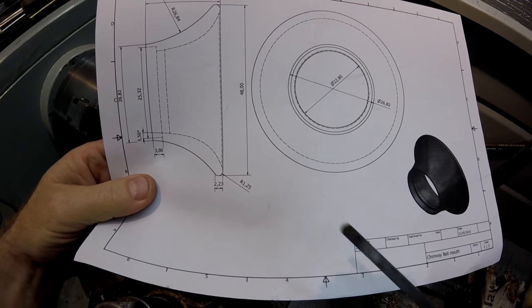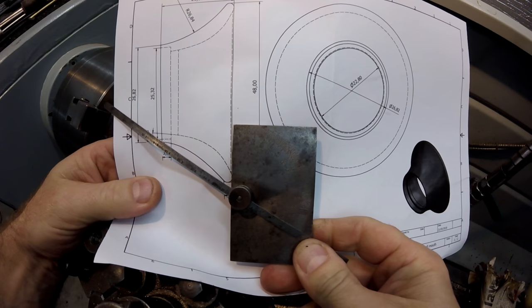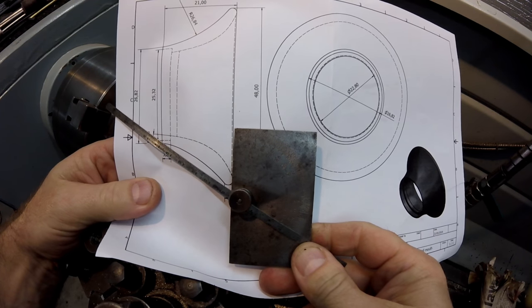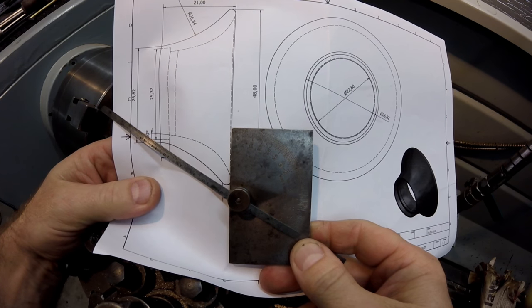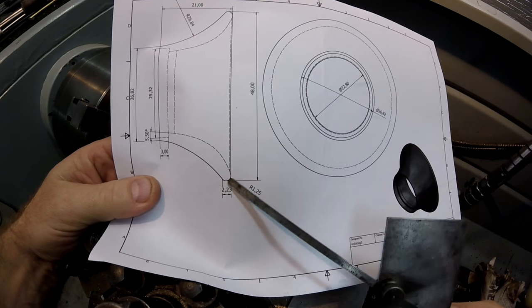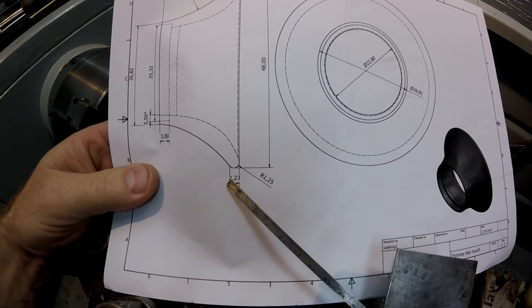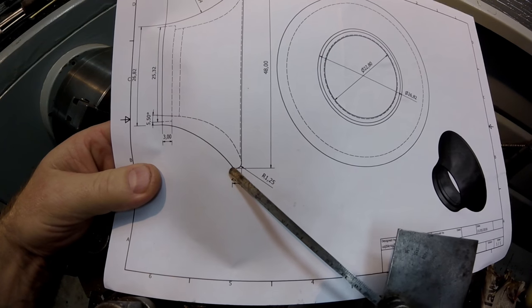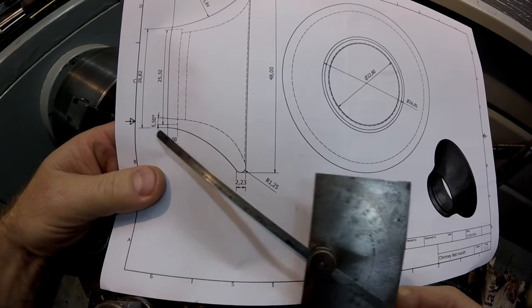Okay, you'll see here, this angle here, you can achieve very close to your finished size just by throwing this across the drawing. You'll see it's about 61 degrees across there. So I can take the compound slide, you'll see this little dimension here, I can come roughly 2.3 millimeters from this end and then take a 61 degree taper across here, and that'll get most of that material out,